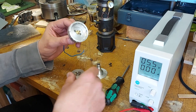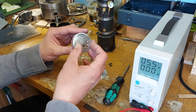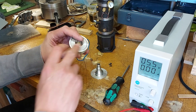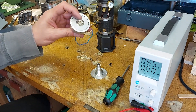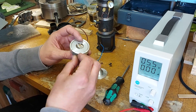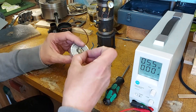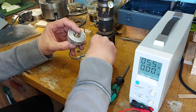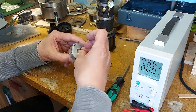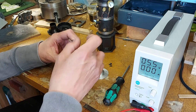Next, the fan goes on the little brass shaft that I fitted onto the motor. What we have to do is put a piece of metal - in this case a key - in through that side there, and that just locks the fan against the case. Then put a washer on top of that and then a bolt on. Once I've tightened that up with the Allen key, that's locked.